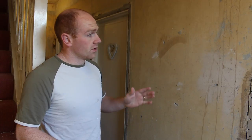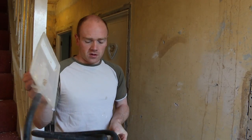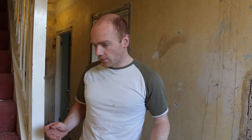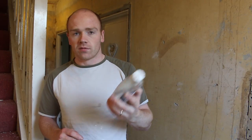A quick top tips video whilst working on the hallway and landing. For most of the house we strip wallpaper with a steamer, which is easy and comes off quickly. The problem is some walls are a bit fragile — the lime plaster — and steaming can cause the lime plaster to blow off the walls. Also, if you haven't got a steamer you need to find something else.